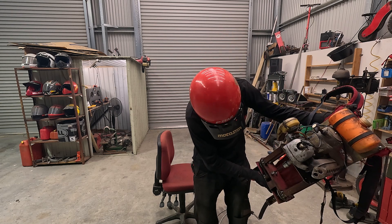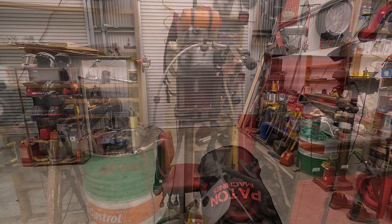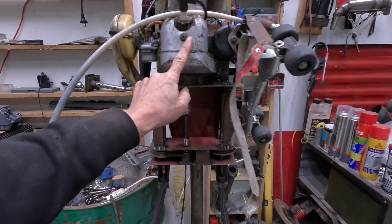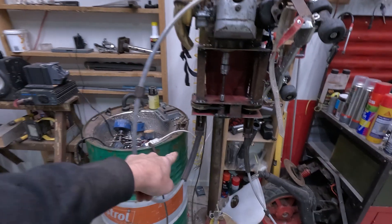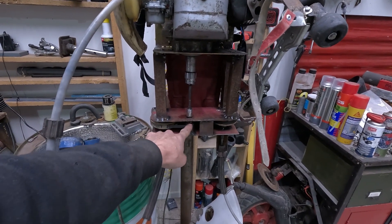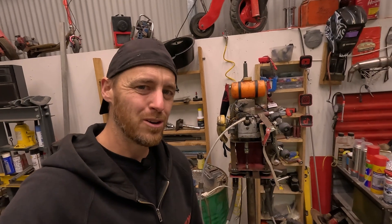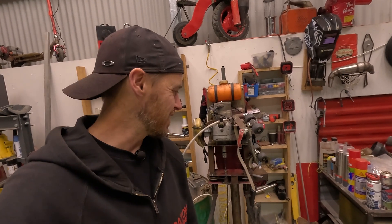I'll see how it's holding up — yeah, not too bad, it's all still together. Alright, I'll get out of this and we'll debrief. So I've had a bit of a think about it and it looks like this system isn't going to work — who would have guessed? But the motor and skates will be sufficient. The problem is that there's too much torque going through these cables. Really, this needs to be one-to-one — not a reduction — just to split the power down to two driveshafts, and the reduction has to happen at the skates. Because these cables like high RPM but low torque. I was planning on just putting it on the shelf, but I had a burst of inspiration and I think I can figure out how to make this thing go. So I'll have one more go at it.